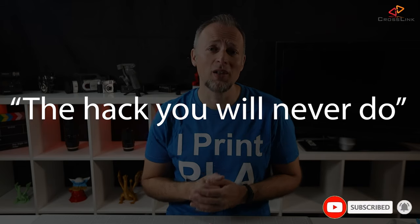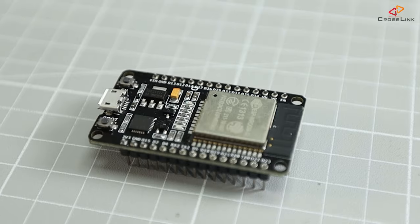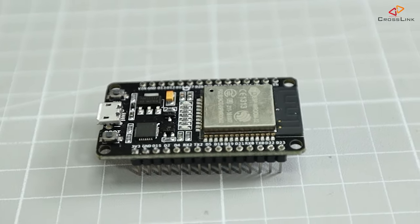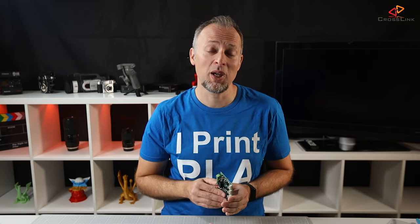This might be one of the most rarely done hacks to the Creality mainboards — breaking out the serial connection pins. For my part, I like to connect an ESP32 to this mainboard over a serial connection and run ESP3D on it, so in the end I hope to get a Wi-Fi enabled Ender-3. But if you happen to have a broken USB chip on your mainboard, using an external USB adapter instead could also be a reason to use this hack.